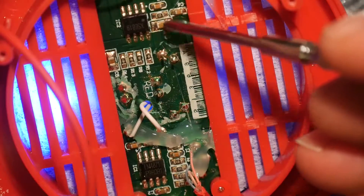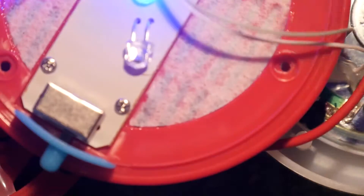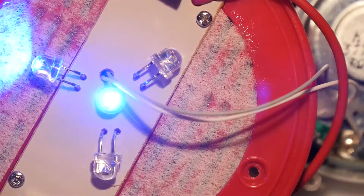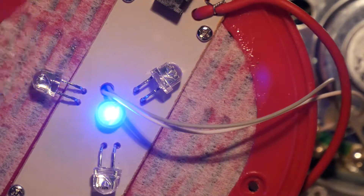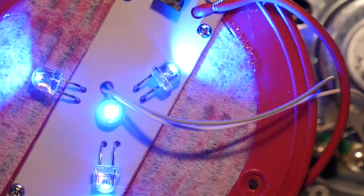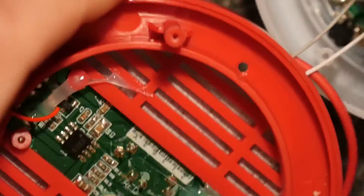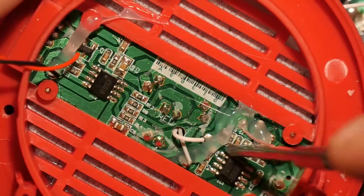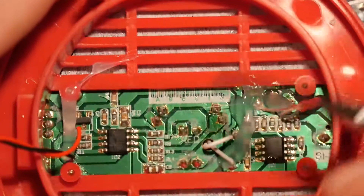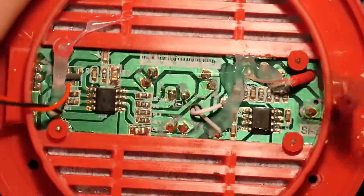I'm just tapping away randomly, messing with the thing. Let's try to figure out what we're seeing here. When we have the sound it's doing these LEDs, but what we don't know is really what's the logic behind these. I was hoping that one of those ICs is actually converting the audio levels and then lighting up the different LEDs depending on the level. I suspect that could be it. You can see what these various resistors are hooked up for. Either of them really could be an amplifier. Look - these are the tracks for the LEDs, so this one's controlling the LEDs. So this XS6819 chip is controlling the LEDs, and this other chip is clearly the audio amplifier - it has to be. That's all that's left.